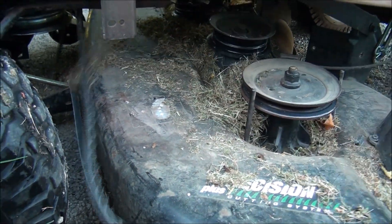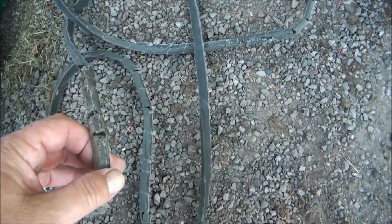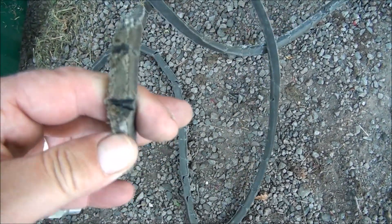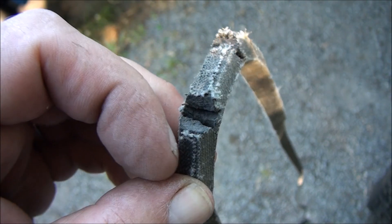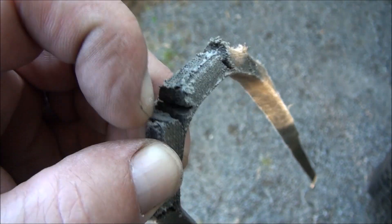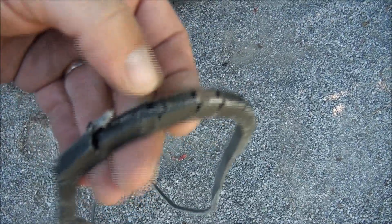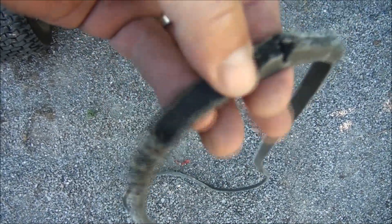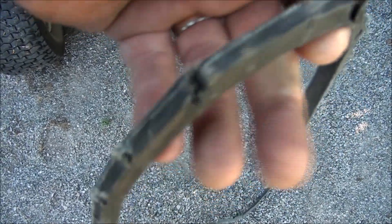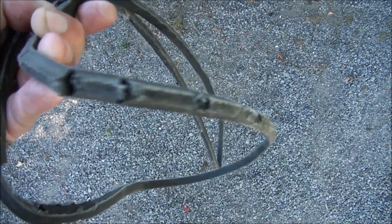One thing's nice — this belt is easy to replace, so we'll get a new one on there. That does sure look like something went wrong with the belt. The rubber is not real soft; it seems kind of brittle, not real flexible. Kind of looks like belt failure to me — the fact that it's cracked all along like that. I think it was just a piece of crap belt. I ordered this belt through a place called the Technology Parts Store, and obviously I wouldn't recommend it.